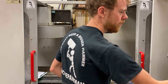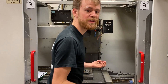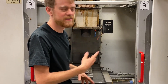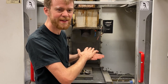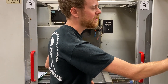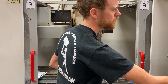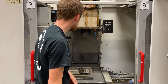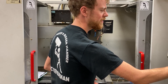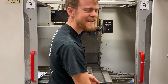Here's 500 RPM — sounds pretty good. Something you'll also want to think about is: is the spindle fan kicking on when I do that? Is the spindle fan turning? Run up there and feel it — I have it unplugged for the video. Go ahead and stop the spindle. You can still hear the hydraulic pump running for the gear bumps. Let's put this at 2,000 RPM — it shifts gears, running pretty good. Let's pick up the speed a little. It doesn't sound terrible.